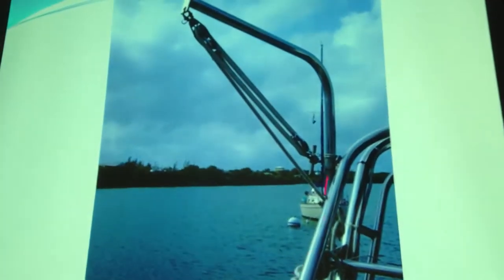The next tip is having a way to raise your outboard and get it out of the water. We have here on the arch on the back of our boat a little davit. This doesn't have a four-part tackle, but it would be better to have a four-part tackle to give you a lot of leverage. We basically attach that to a harness on the top of the outboard, raise it up, bring it alongside, and drop it down on the motor mount.